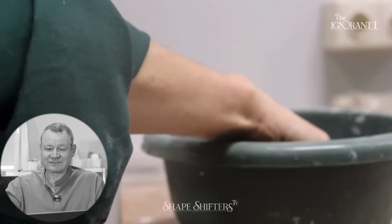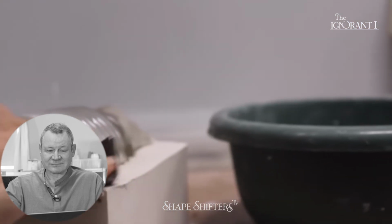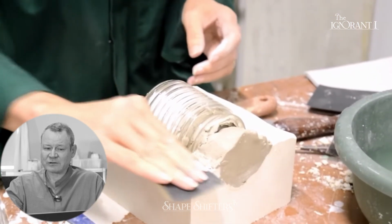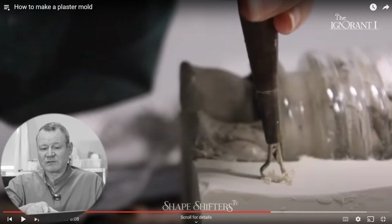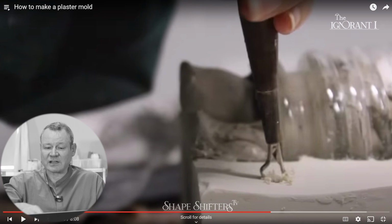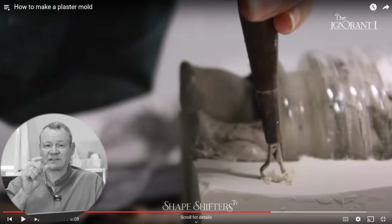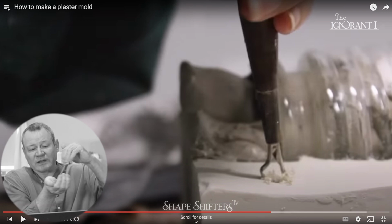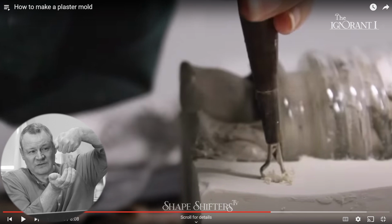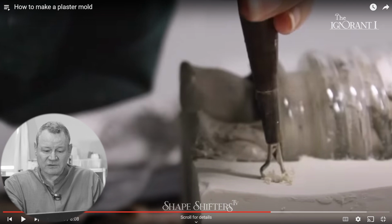Yeah. Sand the plaster mold using a bit of water to make the surface more uniform. Wait, did she just soap? And then she's sanding? Okay, that's not the way to make a key. First off, those tools break really easy. There's not a lot of strength in the neck, and her keys are too small. You need a key that's at least 3/4 inch wide, otherwise they pop off too easy, because remember you're making a male and a female key, one that nests inside, so this one, if it's like a cone, it's just gonna snap off. So this is not the way to do it.